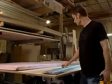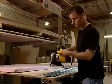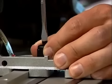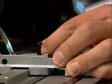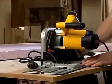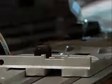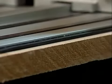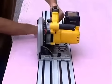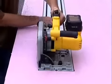Setting up the track saw for the first time is a series of simple steps and should only take a few minutes. First, place the track on a level piece of sacrificial material. Then, using a slot head screwdriver, loosen the set screws on top of the track adjustment knobs by turning them counter-clockwise. Adjust the knobs to take out any play between the saw shoe and track while still allowing it to slide smoothly, then re-tighten the set screws. The next step is to trim the anti-splinter edge for a calibrated zero clearance fit. The depth stop should be set at 3 sixteenths of an inch, then with the saw and track on a piece of sacrificial material, trim the edge. The other side of the track can be calibrated in the same manner. The DeWalt track saw and track have now been calibrated to each other and the system is ready for use.